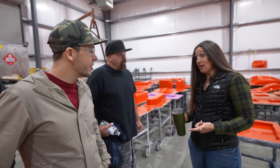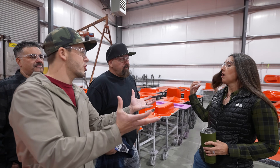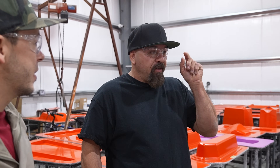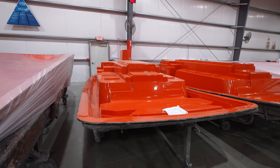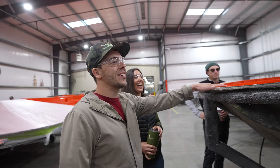Before a mold is introduced into production, we wax it 17 times — wax on, wax off, 17 times. Why do you do that? Because the molds are so big, there's probably so much pressure that you want it to pop off cleanly. In other words, they cannot make a mistake, because one little imperfection on this big boat is bad. Let's go check out these huge molds.